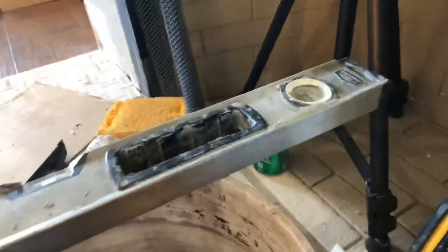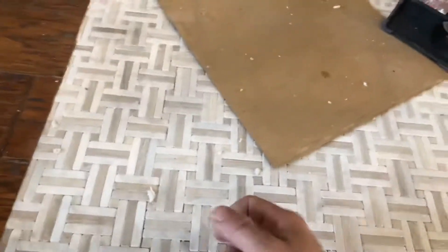If you ever do a fireplace, you can see right here it's a little bit recessed — the material wasn't as thick. For the floor part I used a 3/8 notch trowel, and the wall trowel started at a quarter inch but wore down over time on the slab. You can see how the top teeth are taller than the side ones because troweling the cement slab eats those teeth down a bit.